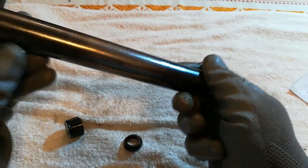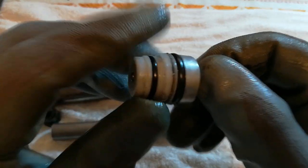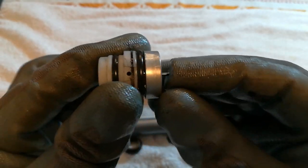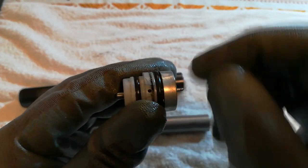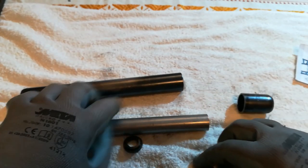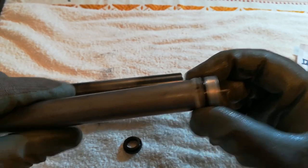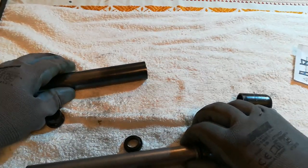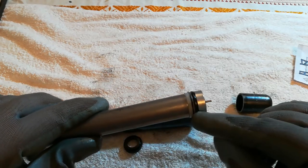This bushing goes inside the cylinder, and everything sits inside this pipe — so you have pipe inside a pipe. We also have a valve on the other side. See this little hole? When you press this needle it opens up and opens an airway. This o-ring over here goes inside this pipe to seal everything, so the only way air can go is from this cylinder to this cylinder through this very small hole.